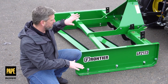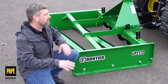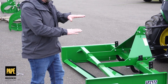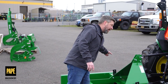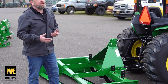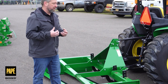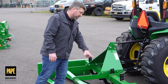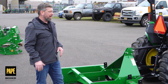Additionally, you can set from left to right on this a little bit more. So if I wanted to create a little bit more crown in the road, I could set one skid shoe a little higher than the other, and that will allow me to crown the road a little bit better. This also comes with scarifier teeth — something our box blades have had for a long time. These do a great job of digging into the earth, mulching and grinding up that gravel and refreshing it before the two reversible blades move that material and even it and smooth it all out.